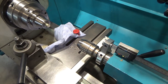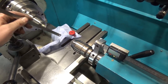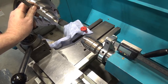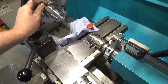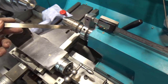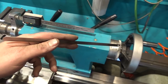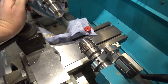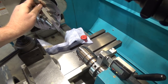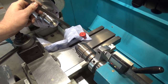Change of plans — I thought you might find this interesting. If I did the large drill first using the depth stop, drill 0.75 inches deep, then do the full through drill after removing the depth stop, that all seemed like a great idea because the depth stop would mean parts always go in the same depth, and I can use my DRO on my tailstock to go 0.75 inches each time. Here's the problem though: normally when you want to quickly remove a drill bit from work, you release the brake on the tailstock and slide the whole tailstock back — but I can't do that or I'll lose my reference point. If I wind the quill out enough to get the part out, I'm going to have to wind back two inches each time. So it's just going to be easier to find my zero each time.